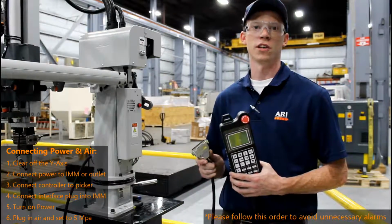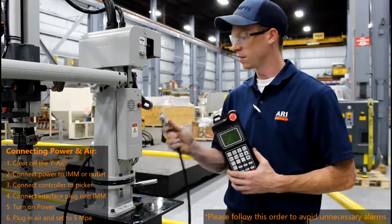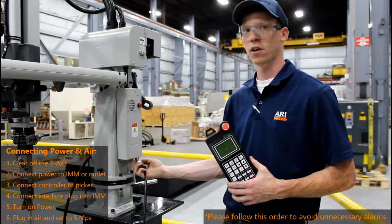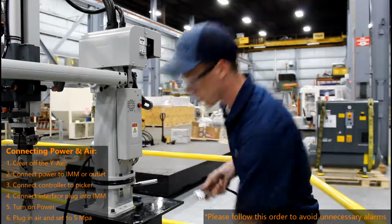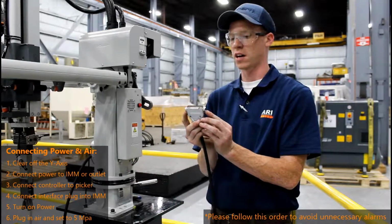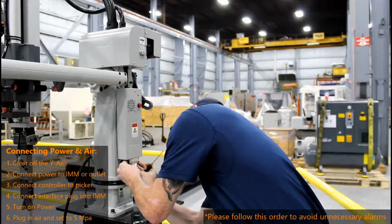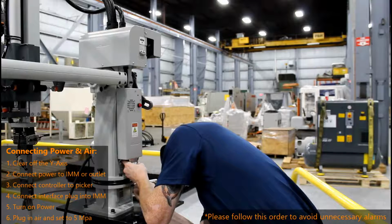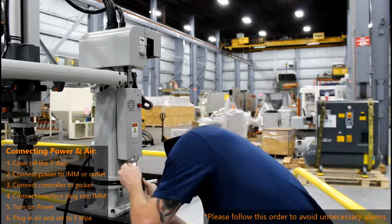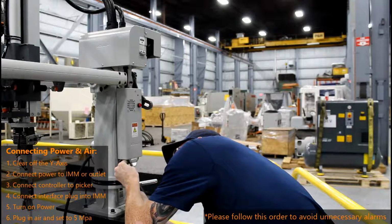Once you have power hooked up to your sprue picker, it is now time to hook up your controller. This controller is hooked up directly onto your motherboard, which is located inside your control panel. There are 2 securing screws on either side that need to be screwed in to ensure a good connection. Be careful not to over tighten the screws as you could damage some of the pins.